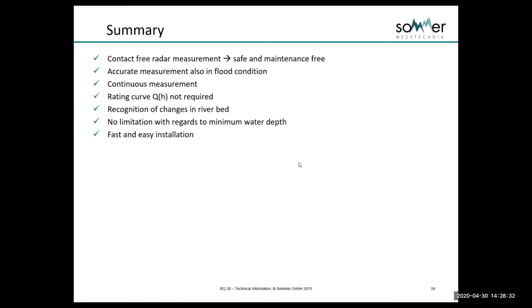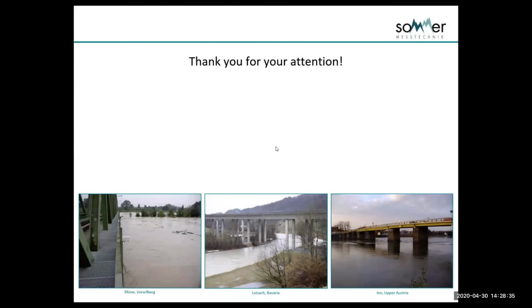There are a couple of things I'd like to cover, and then I'm going to open it up for questions. It's really important to know that this is not a silver bullet. It's really important to know where we can use this and where we can't. The level radar can see right down to zero. The velocity radar looks out at an angle of about 58 degrees, either upstream or downstream, and it's getting its echoes back. It's measuring velocity by echoes returning off very small surface waves, ripples, pardon me, about 1/8 of an inch.